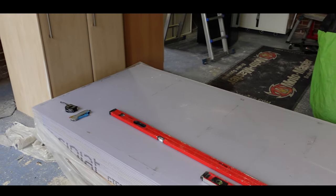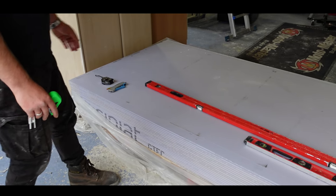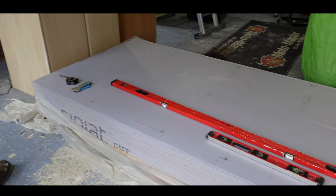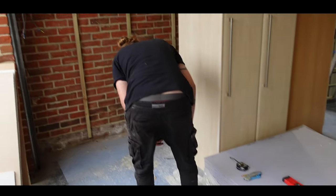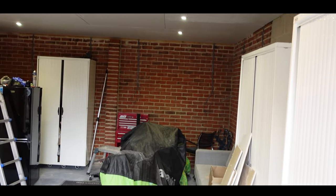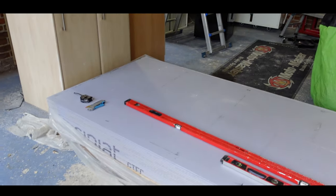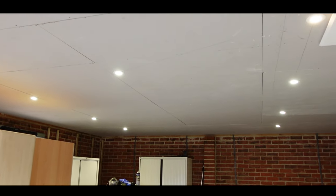These are the wall boards — we've got tapered wall boards. They've got a tapered edge so you can tape them and they're recessed a little bit. We've got to finish the battening. First board's going over there. We haven't battened all the way around yet, but I'm hoping this is going to be much quicker than the ceiling, because the ceiling was a killer.